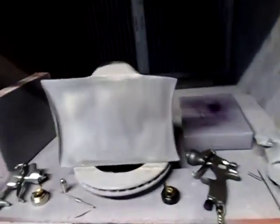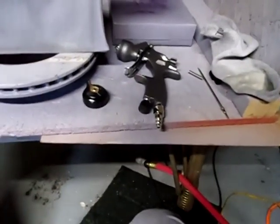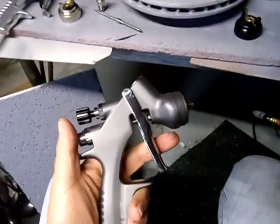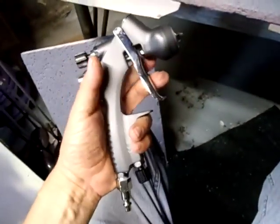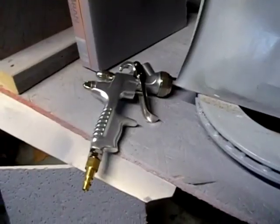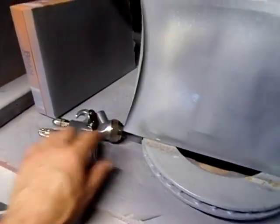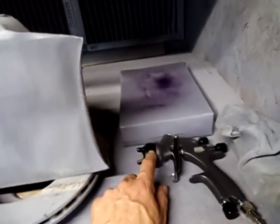That's a good summary so far of this gun. I'm going to practice more, pulling the gun further back and seeing how it performs. One more thing I left out: the air cap threads. These are fine threads on the RF2103 and coarse threads on the Vivore. The Vivore has an advantage there, but these threads are nice so far — though with a little paint on them, fine threads could become an issue.